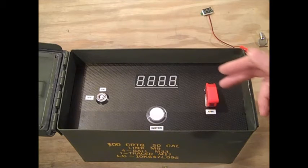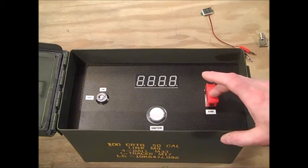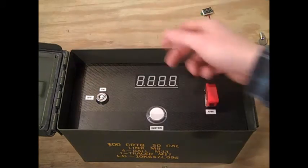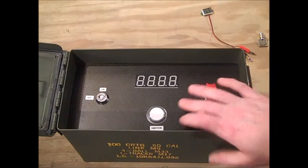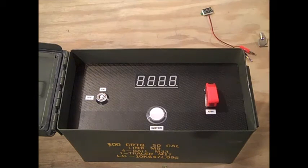I used normal drills with tape over the surface on both sides to minimize splitting. I drilled all the holes a little bit small, and then used a Dremel and test fit each part to make sure I didn't overdo it and have a loose fit. Of course, it's also conductive unless it's coated — mine is raw, so it's not coated. It's conductive, so use an insulator of some kind when you mount your PCBs to the bottom of it. I used cardboard because I'm cheap and I had it lying around.